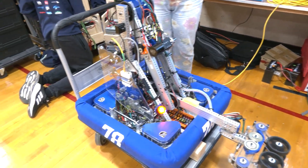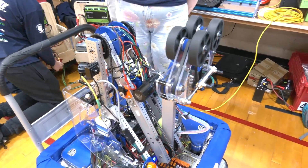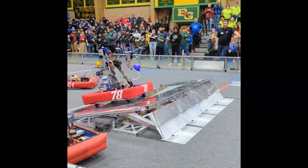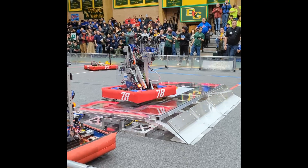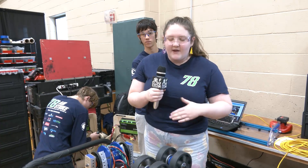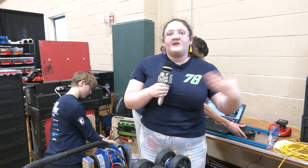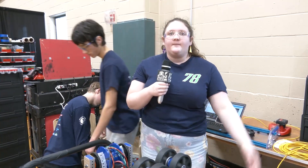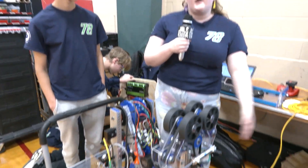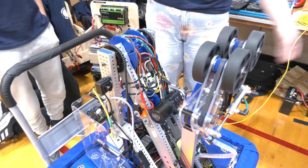With our different presets it's very accurate with our degrees — we have a dead band. In auto, we plan to incorporate the arm in certain positions later on. Have you given any consideration to auto balancing? Yes, we actually do have an auto balance we are working with today. Using our gyroscope, we can read our angle on the charge station — we can tell if we're climbing or level — so it can change our speed and how we approach it. We have a cool mechanism where all of our wheels turn inward and lock our robot so it can hold its position on the charge station during auto.